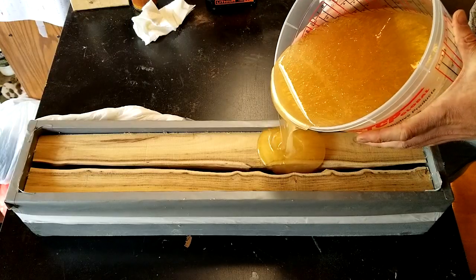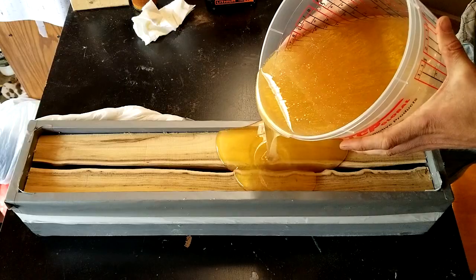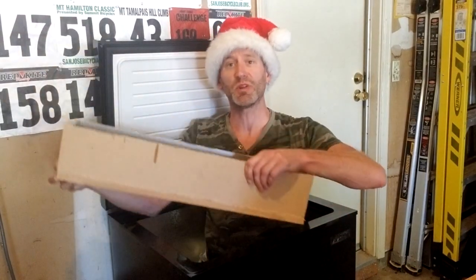I then poured the mixture into the mold that I had pre-cooled in the freezer. When working with such large volumes of epoxy resin, I found that pre-cooling the mold in the freezer for a couple of hours is a great way to keep things cool and prevent the liquid from bubbling out of the mold. But man, it's cold in here — I really need to think of a smarter way to do this.